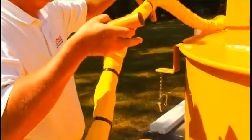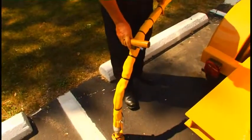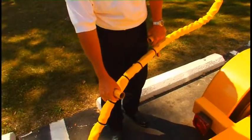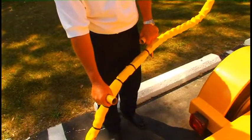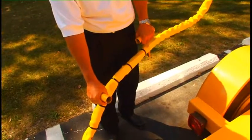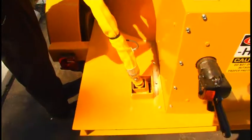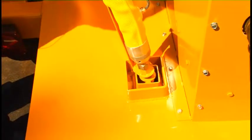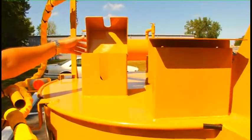Remove the wand from its holder. There are two switches on here — my left hand operates the pump, and my right hand operates this switch which flashes a light so the operator can tell the driver of the truck when to stop. The wand goes up into this heated receptacle, which keeps the applicator tip free-flowing. Any time you want to recirculate product, just open this door and put the wand applicator up into the slot.